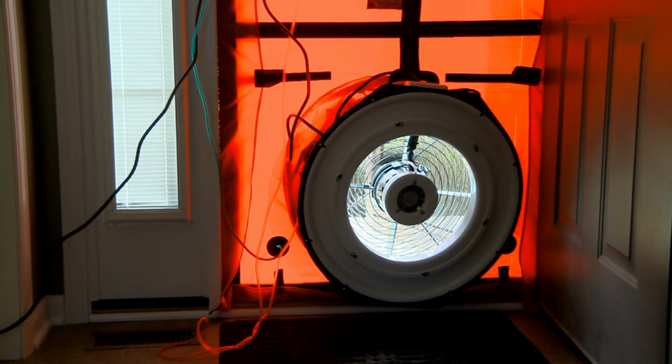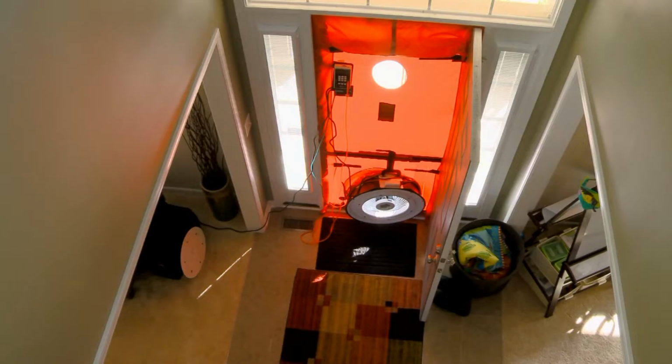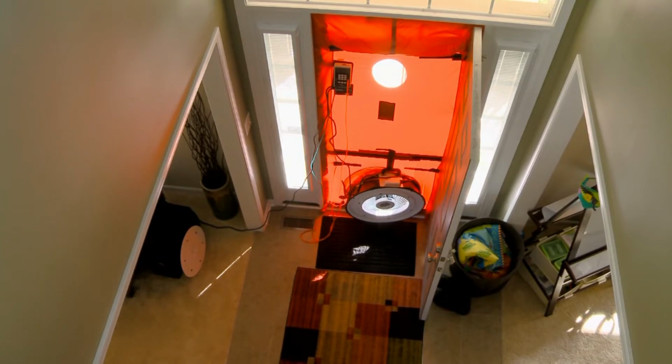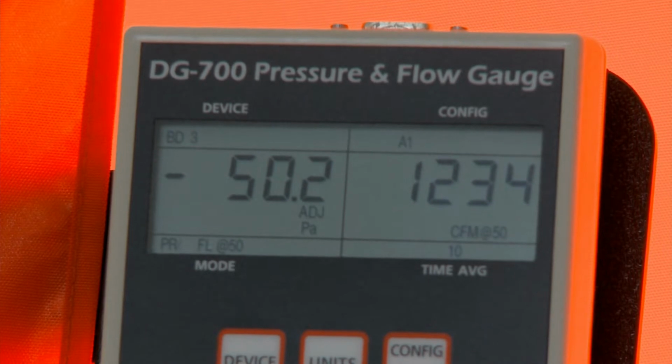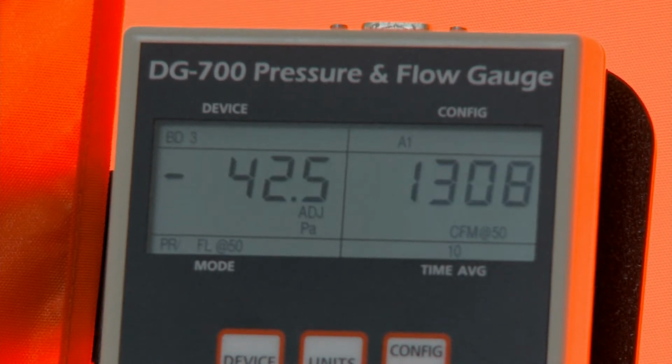Okay, and so what becomes part of the test? What are the factors in this, or equipment that would be used? Well, we'd use a blower door. The blower door is a big one. Our energy codes are requiring us to be at a certain air leakage rate and under. And nowadays, with the buildings getting tighter and tighter with the energy codes, we have to verify how much it's leaking. Right now, the air is leaking out of this building, but we don't know where.